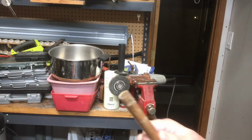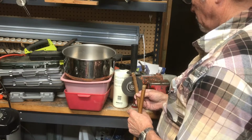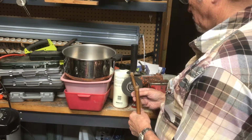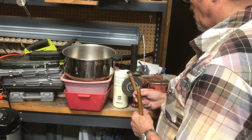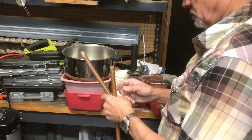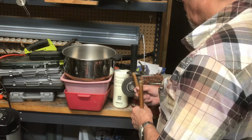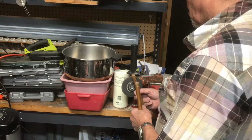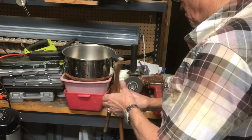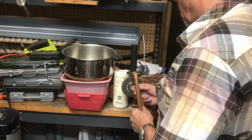So I got all the legs done inside, but I'm going to take these spindles, and I've got my grinder sitting in my vise there, and that's just a grinding wheel on there, and I'm just going to spin it and cut some grooves all the way around on both ends of this. Again, that gives that glue a place to hold. And the spindles, looks like they may have had some flutes in there, but they're so small. They run the other direction, but they were so small and filled up with glue that I just didn't think it was going to do any good.